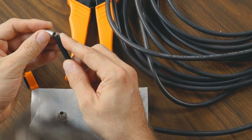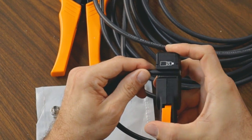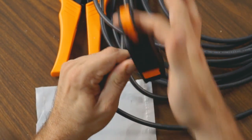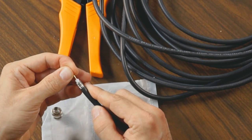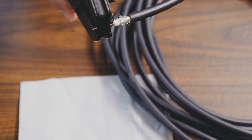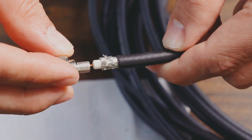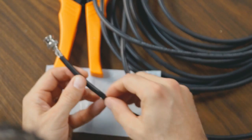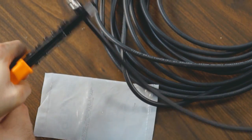Once you have that working, take the bare end of your cable and put the sleeve over it. Then strip your cable — it's just easier to get the sleeve over before you have the braid exposed. Now take the pin and put it on the end of the center conductor. Then using your crimp tool, crimp the pin to the center conductor. Finally, take the connector and slide it onto the cable, making sure to get the pin through the hole in the center and have the back part of the connector slide under the braid. Now slide the sleeve up over the end and crimp the sleeve down. Do the same thing on the other end and that's it — you've made your own SDI video cable.